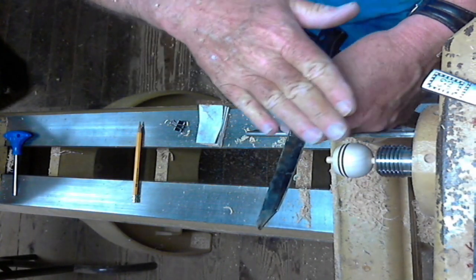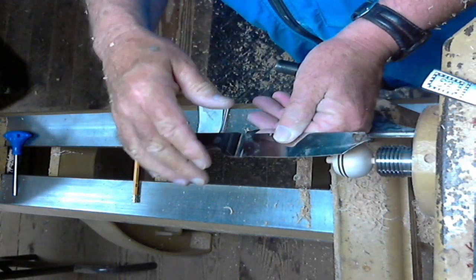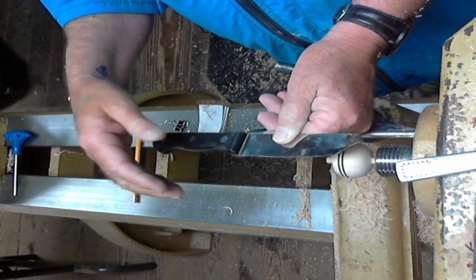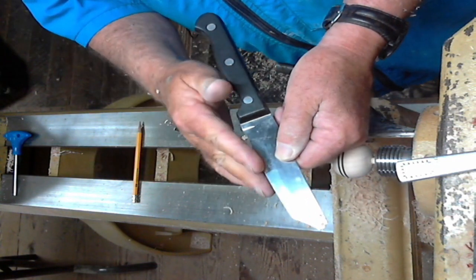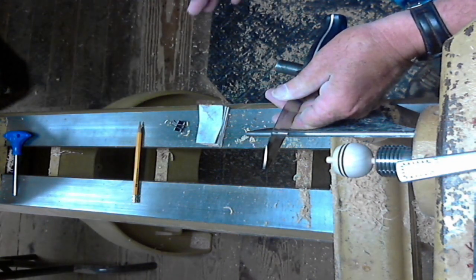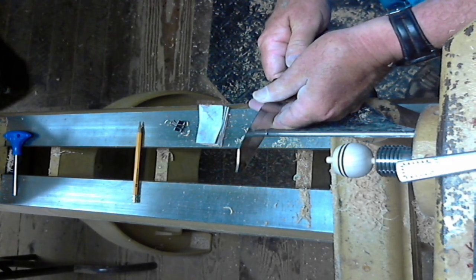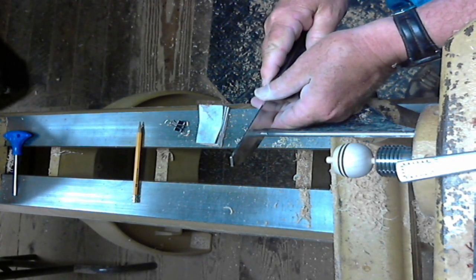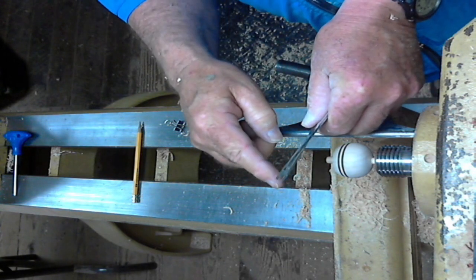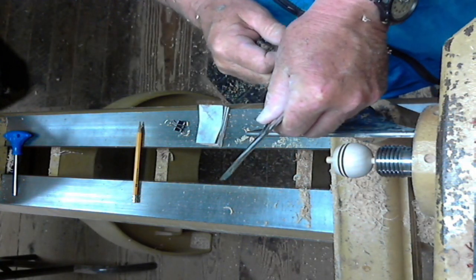I had a flat tool rest on my grinder, and what I did is I took out all the serration and got rid of that on both knives. Once that was done and I was pleased with the shape, I rounded the edges so it wasn't sharp, comfortable in my fingers. Then with the V-groove base for the Varigrind system, I brought this up to the wheel like so, and flipped it over and did the same. You'll notice that more is cut out at the top. This is the bottom. That way I can get deeper in without raising it from the tool rest.